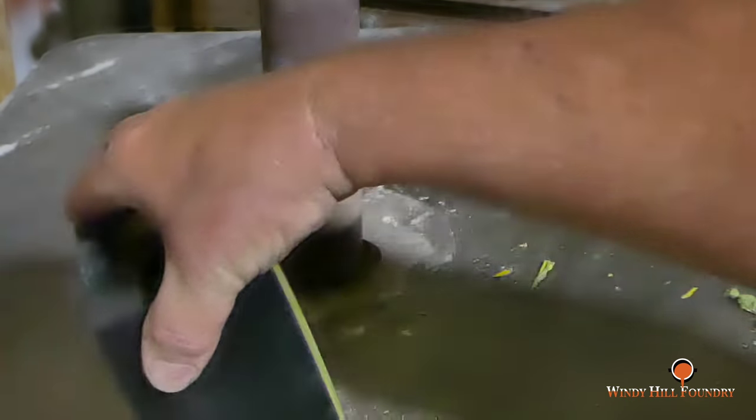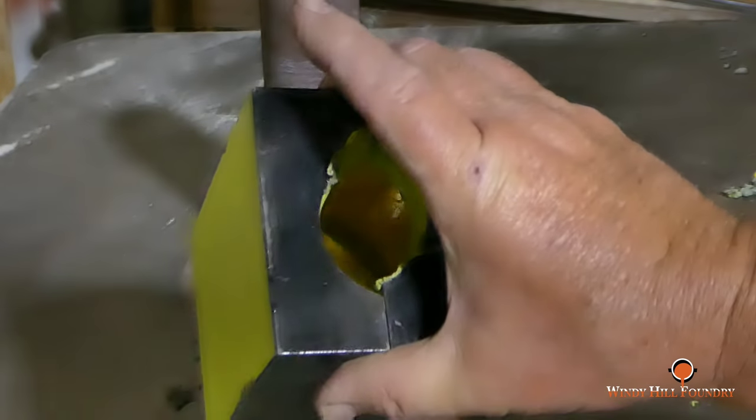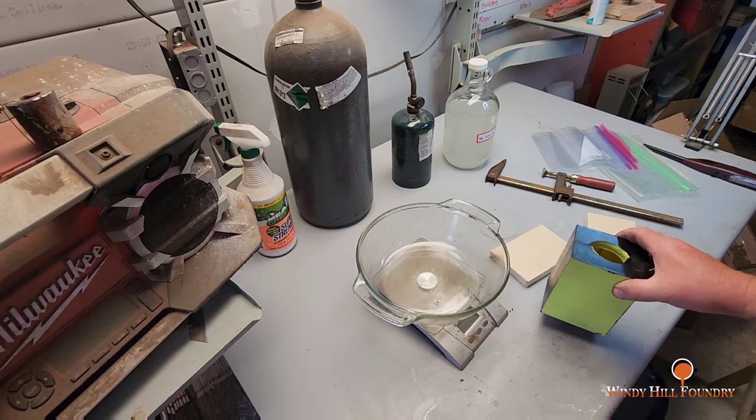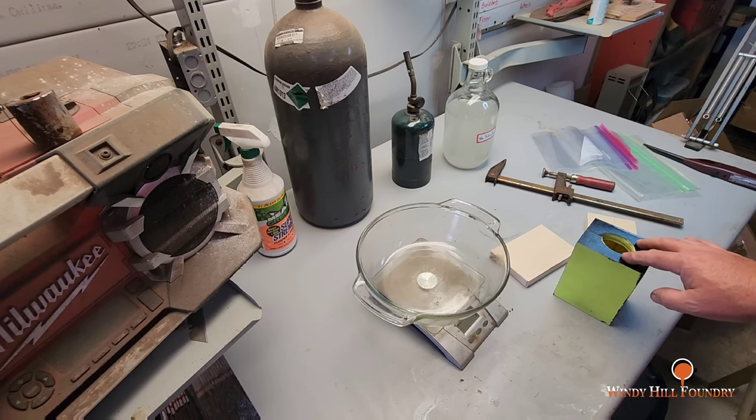The hole does not have to be perfect — it's only an access point to get the sand to round down in there, because this is my sodium silicate gassing setup. It's normally not this neat, but anyway, we got our core box here. I'm doing this one day in advance because I always put my cores in the kiln and dry them out thoroughly — any moisture in there, we want it out. I had so much moisture in a core several years ago that it actually blew the mold apart; we don't want that. We want good quality castings every time.